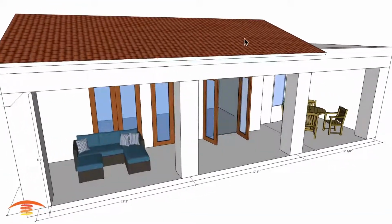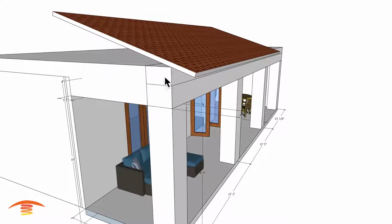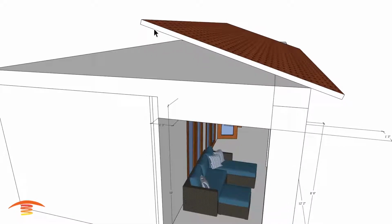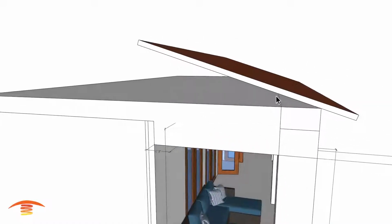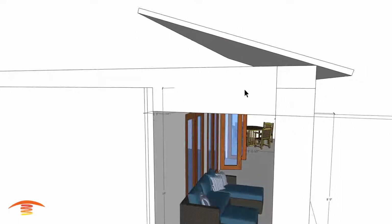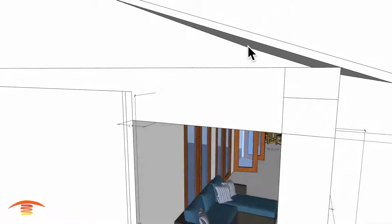Now the customer did have a sloped ceiling, and they were wondering if they could do flush mounts based on that. This over here would be a balcony, but we don't really know what the architect of this is. I would assume that the structure is probably coming down in this direction, so there's really probably no way to put a heater in going along this direction without redesigning this entire space up here. I can only imagine they have the joists going this direction. So if that's inside of this soffit area, then you'd have to cut all those out and redesign the whole structure so that it would be structurally supportive of the rooftop there.